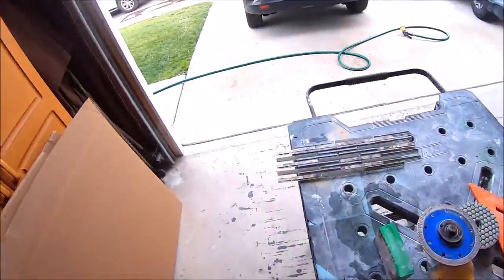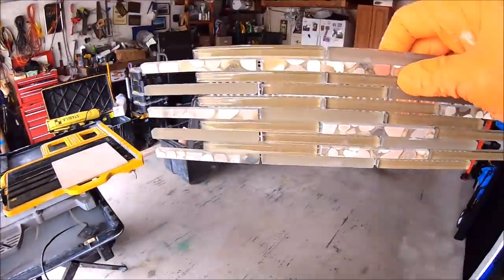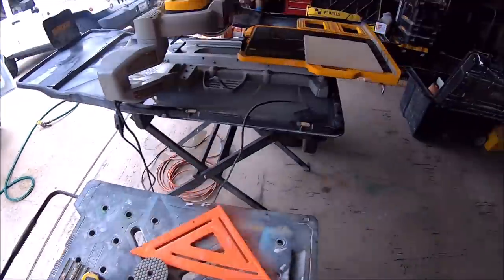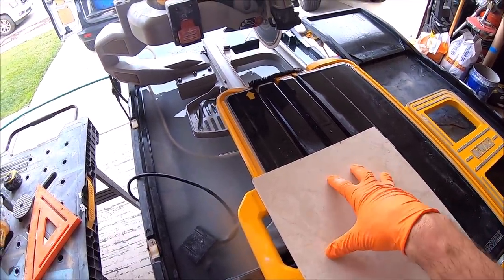So now it's time to put spacers in. When we get up to where our glass will be installed, we don't want to stack any weight on that glass, so we're going to cut 4-inch spacers from the field wall tile, temporarily insert them where our stripe is going to go. Here's the glass, 4 inches. This will be for the deco stripe running all the way around the shower. So we will cut our 4-inch spacers to hold the tile that's suspended above these.